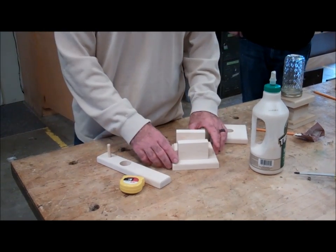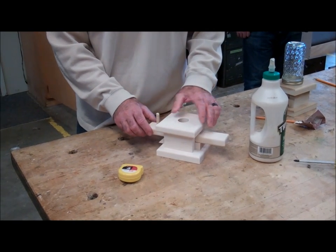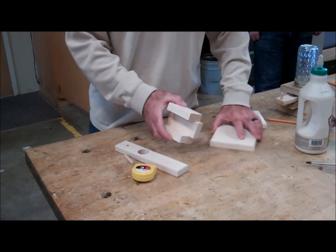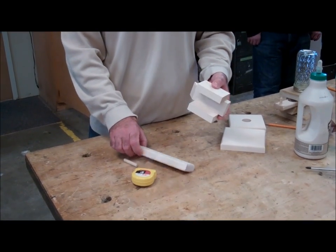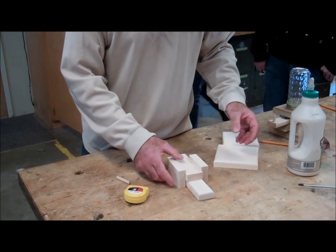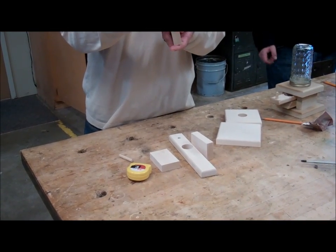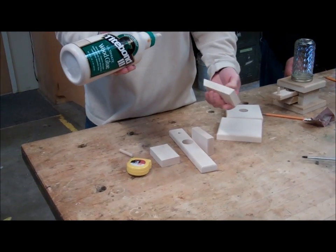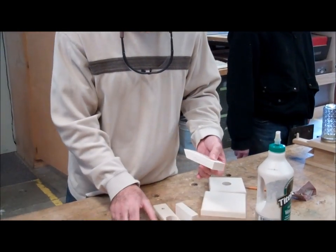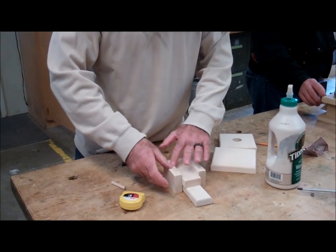The way I'm going to assemble this — I want to make sure that when this thing pulls out it lines up, and this is a good fit. The real bond is the glue; the nails just hold it there until it dries. This is really nice maple. You've got to be somewhat careful with the glue because wherever you glue it, if you're going to oil and stain it afterwards, the stain won't stick where there's glue. So you want enough glue for a good bond, but not so much that it pours out everywhere and prevents staining.